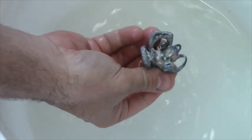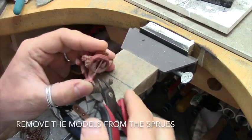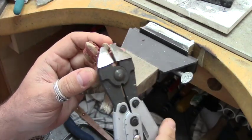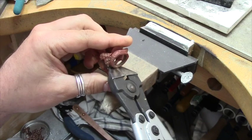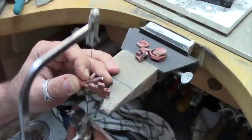Later, you can make rubber molds of your castings to then make reproductions. First we will remove the flask and clean it off a little bit. Now let's find those models — most of the plaster will have just dissolved off from the intensity of the heat on the metal and the water. And there are our metal models. Time to remove the models from the sprues. Here I am using special pliers that can cut through 10 gauge sprues. And now I have some thicker sprues to cut, so I am going to use these sprue cutters, which will cut through some of the thicker sprues.